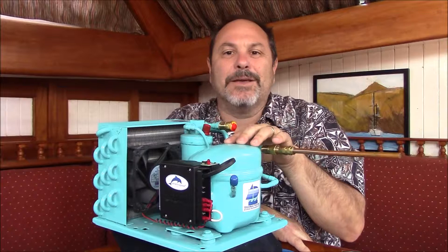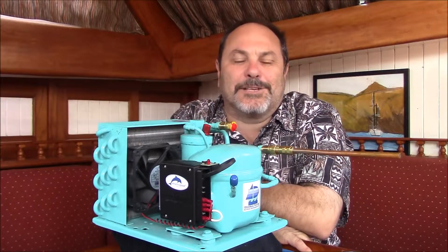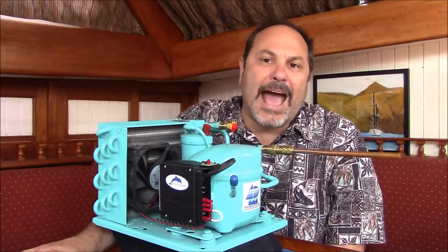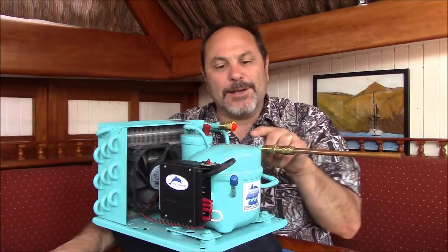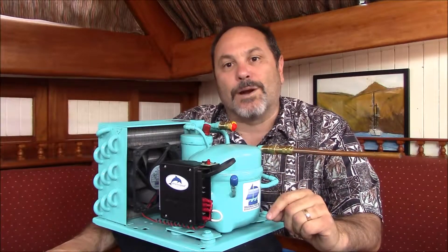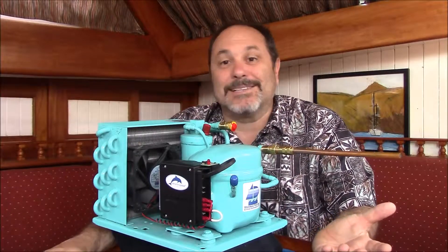The compressor is basically doing two things at the same time. It's taking and putting high pressure on the high side of the expansion valve. Then as the liquid refrigerant is injected into the holding plate, it's sucking back that refrigerant gas. In order for the gas expansion to reach the proper low temperatures, the compressor needs to suck that gas down to between zero and five PSI. If the reed valves are worn out and you're not able to achieve that low pressure side suction value, it's just never going to get cold.